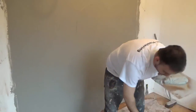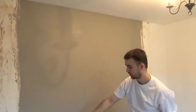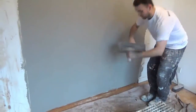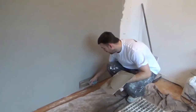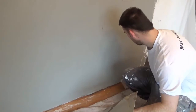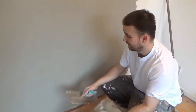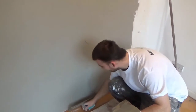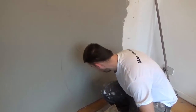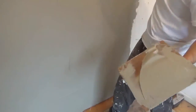Remember, guys, the whole wall is important, but cleaning angles, clean joints, and keeping it neat along the bottom so you don't squeeze. You don't want a wall bellying out, because when your skirting comes, the joiner doing the work is going to have serious issues with you. So keep it tidy and straight at the bottom, even if you have to run your trowel along it.